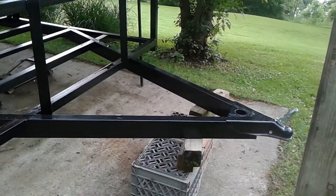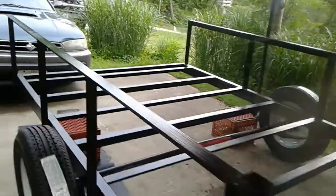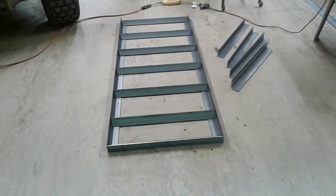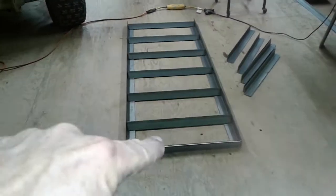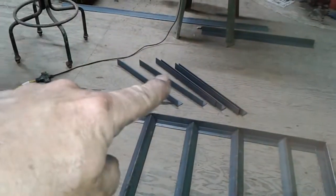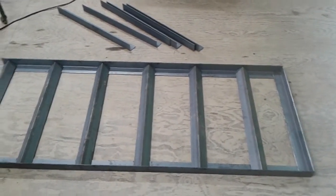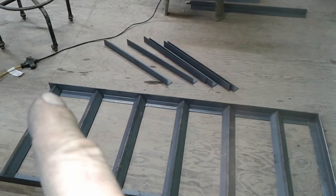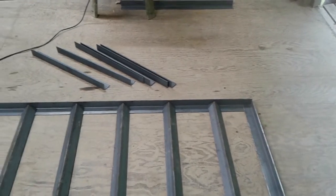Still got to put the load jack on the front of that. Let me take you to the garage and show you the setup for the ramps. These are about two foot wide, 10 and 3/8 of an inch on center, which divides up the 62 inches I need to go in the slots on the trailer. A lot of grinding and fitting, and then we'll get to tacking everything in straight. The only thing I've got to clear is an inch and three-quarter where it slides down in that channel.